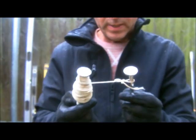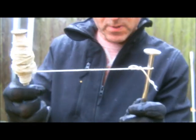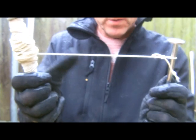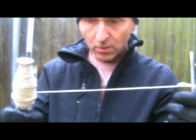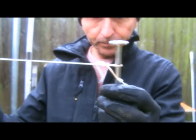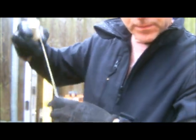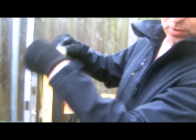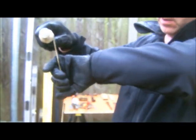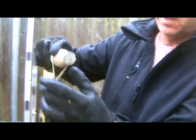Finally, when we come to lines and pins — I always have all of my line on one pin. If you have 50% of the line on each pin and you break it accidentally, you'd have to join it with a knot. So I keep all the line on one pin: if it breaks three metres down, I only lose three metres. When hitching your line, loop it over the top towards you, loop it again, then put the head through the top and you get a hitch, so if the line falls on a scaffold it won't go all the way to the bottom.